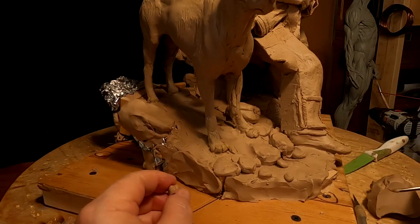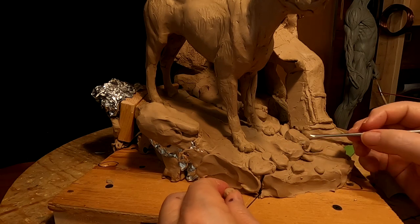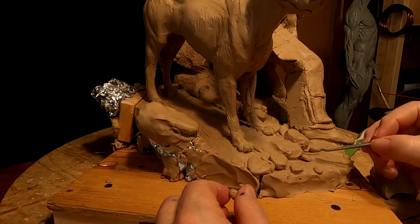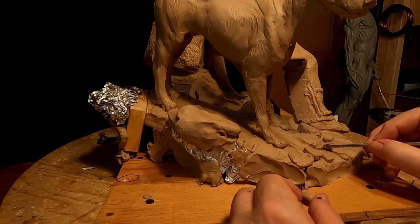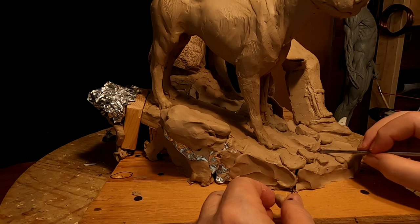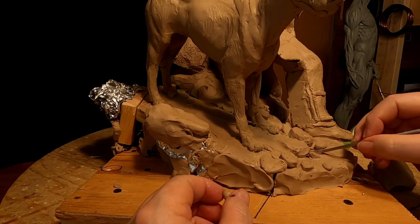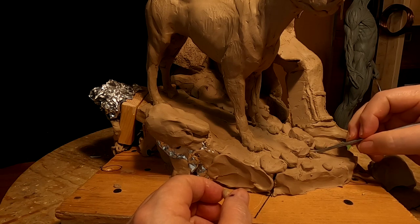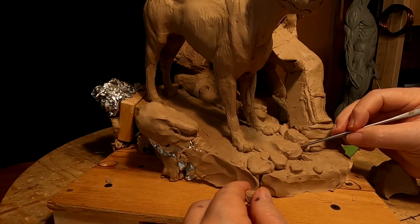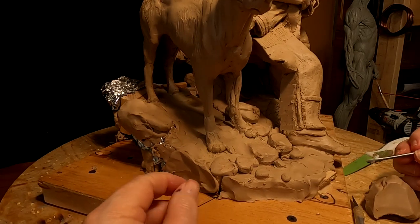Now, it may not work, and the reason I say that is because bronze shrinks. That's why people can't make a copy of a famous bronze from a bronze — what happens is bronze shrinks and it'll always be smaller than the original. So that's how they can detect a copy of something. Besides that, you'd have to cut the original apart, and if it's a really valuable bronze, nobody's going to be cutting it apart. Believe me.